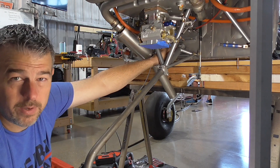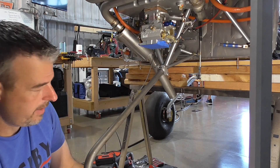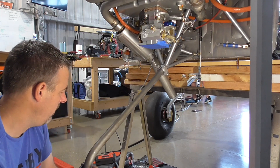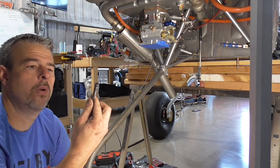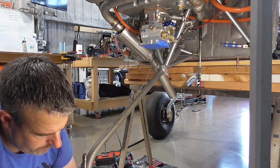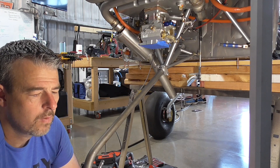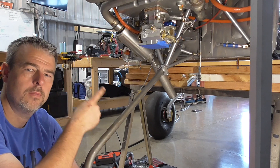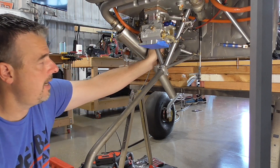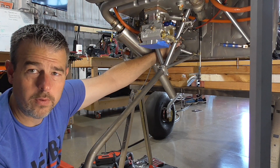So if I had to do it over again, I would have done the same thing — drill press. So now we're at five-sixteenths. The next step was the bigger bit. So we pulled it back out and we drilled it to — what is this guy — 0.368. So drilled it in the press to 0.368, came over here, drilled this to 0.368, slid this guy up in here, dropped it in, and drilled all the way through to the bottom.